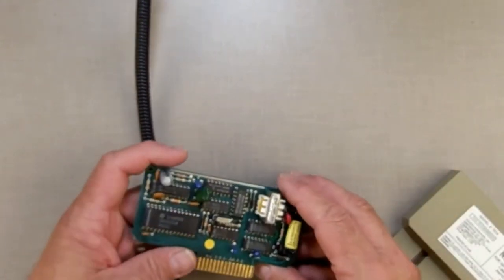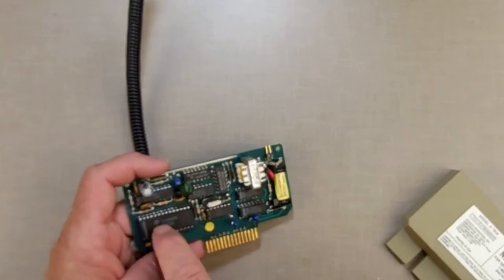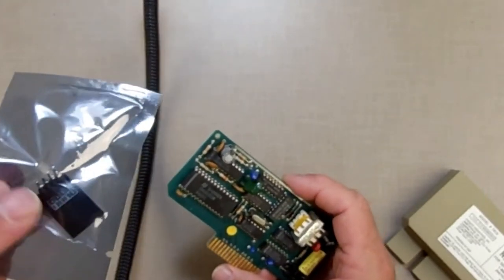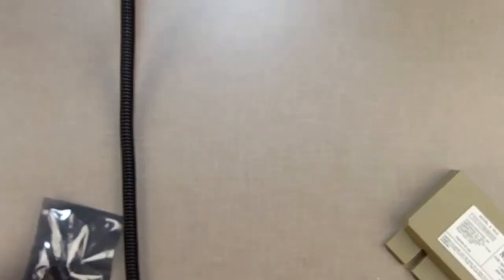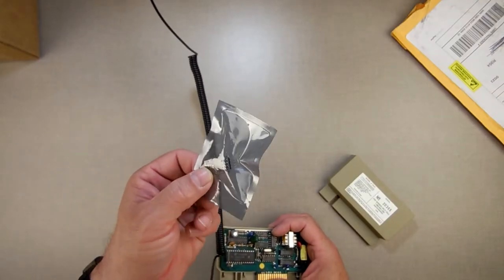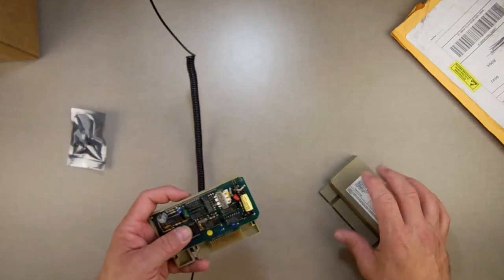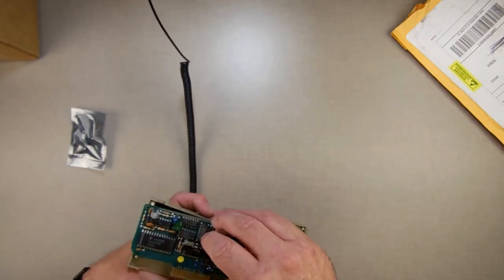So the project I have planned is I'm going to be lifting this out here, removing this, putting a socket in here, and then mounting this in there with some extra power adjusters to get this from 5 volts down to 3.3 volts. I'm going to give this thing the ability to do Wi-Fi and to go on terminal, because this is a terminal emulator. The software you put in here runs 1200 baud, turns this thing into an AT Wi-Fi modem that's AT compatible. That goes in there, and I'm going to have me a little Coleco Adam modem